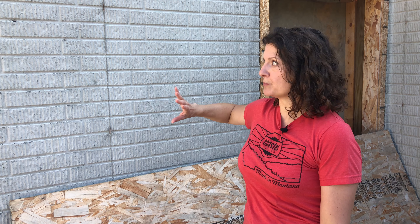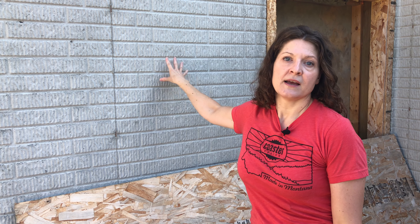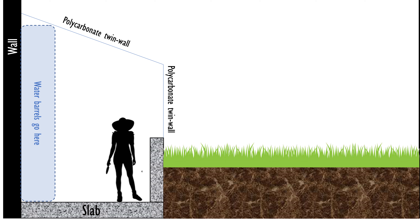I'm going to move to a section view to explain it better. My plan for thermal mass is to put 55-gallon water barrels painted black against this wall. Those are two feet in diameter and about three feet tall. I'll show this with a section diagram drawn to scale where you can see the two-foot depth of those barrels off the back wall.